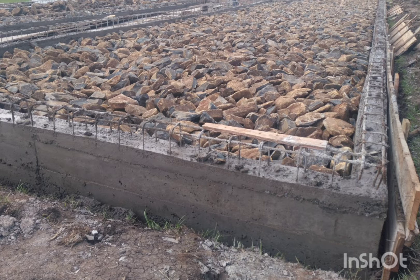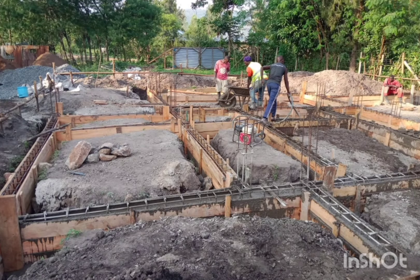So basically you have a rectangular mesh steel structure that has two bars of D12 at the top, two bars D12 in the middle, and two bars D12 at the bottom, then ringed up with D8 at 200 millimeter center to center. You'll have done the setting of your house and established the walls. Then you excavate a width of about 600 millimeters, but you don't go very deep — just about a foot — because in serious black cotton soil areas, no matter how deep you go, you won't get firm ground and it may not have any impact on the structure.